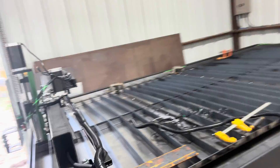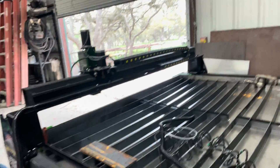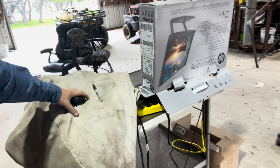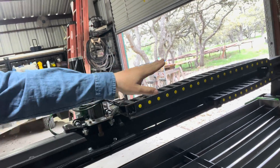The only thing that was not really explained in the instructions is what to do with all this wire over here. After you get done, all this wire runs all your motors and everything, and then they come out to here, which runs into your controller, which is under this piece of cloth, and then your computer and everything. So what I want to do is run all these wires kind of like they did on the gantry up here, using one of these cable tracks.